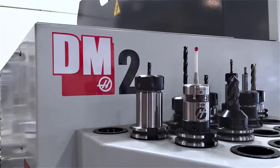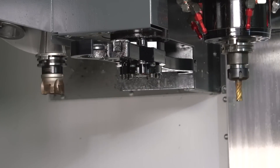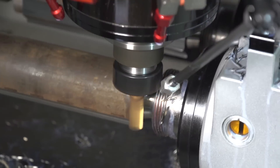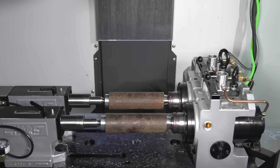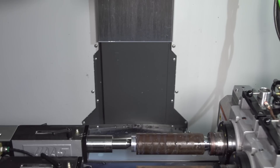All the great features of the DT and the DM-1 are still here. We've got the super fast tool change, the 2400 inch-per-minute rapid, and we were able to keep the same accelerations and speeds even though we have more mass to move. And the 15,000 RPM spindle — that's whether it's a DT or a DM. So the demo we have here today features the HA-2TS rotary. In this case we're cutting steel, but we're not doing a heavy aggressive cutting demo — we want to show the speed of the machine. You'll see 15,000 RPM on the spindle and a lot of fast rapids. Let's run it.